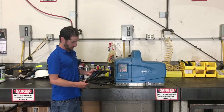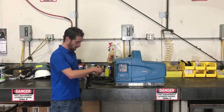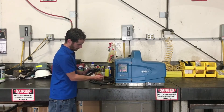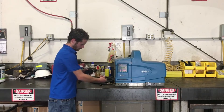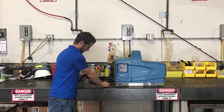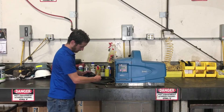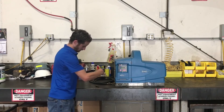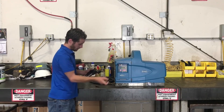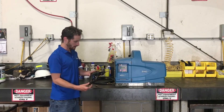In order to take this off, you want to make sure that it's a little warm first, just so you don't strip anything. You don't want it too hot so you don't burn yourself. Take a half-inch wrench, go counterclockwise — it comes off. Take your new nozzle, just use your hand, simply give it a slight turn, make sure it turns easy. Take your wrench, go clockwise, make sure it's tight so you don't have any leaks. And that's how you change out a nozzle.